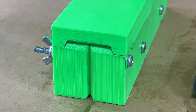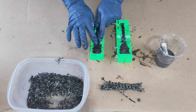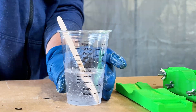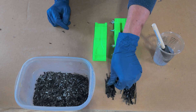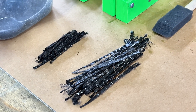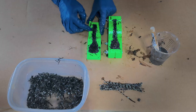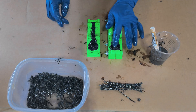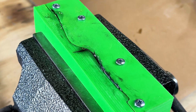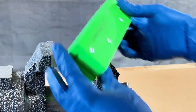My goal here is to create the ultimate reusable 3D printed mold. So let's get started. Yesterday I applied the mold release, mixed up my epoxy, brushed it on, and stuffed it with carbon. For this part I'm using long strand, medium strand, and short strand. For more details on this process you can check out my other videos. Then it was time to squeeze this together and clamp it in the vise, and I let the parts cure overnight.